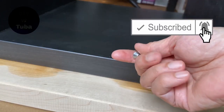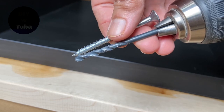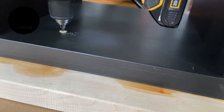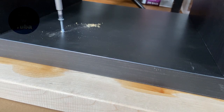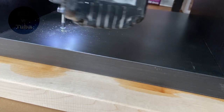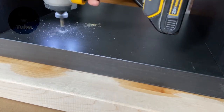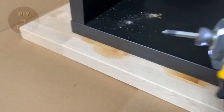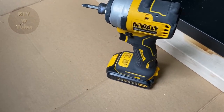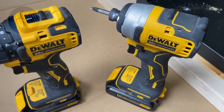Now I am going to screw the shelves to the butcher block with these wood screws — they are two and a half inches long. First I am going to drill the holes with the right size drill bit. After drilling I put my screw down, but I ran into a problem — it didn't go through. I guess I didn't drill it long enough, so I came back with my impact driver. These are amazing, they are so strong, great for tough jobs. As you see it just went through. Mostly I use my drill, but every once in a while I use my impact driver. Now I've got four screws in and glued the whole thing, so I should be in good shape.